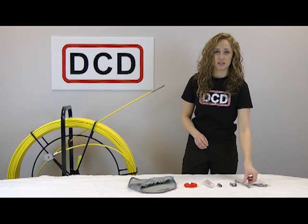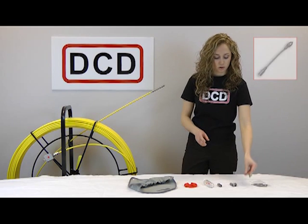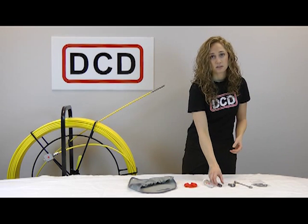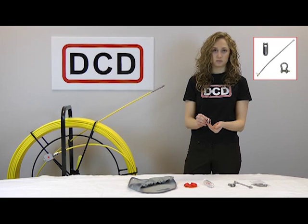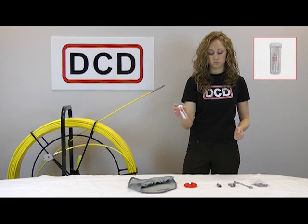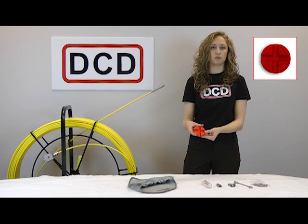The flexible guide head can help going around duct corners and tight bends. The roller guide is great for passing existing cable and duct work. The clevis end can be used for pull backs utilizing small wire mesh grips or small shackles. The kit also includes glue for attaching new male fittings or splice connectors, and the rod gripper gives you extra grip while pulling your rod.